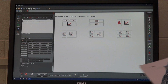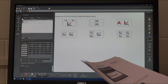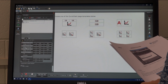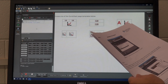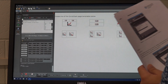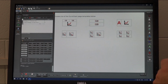The second one is going to be volume, which is going to be equal to 2.26 E negative 5 times voltage of sensor B, which is for volume. We already connected to connection B, plus 8.56 E negative 5. Now it's time for unit. For volume, definitely it is going to be cubic meter. So now I found it from the available volumes presented there.